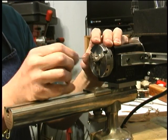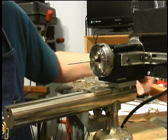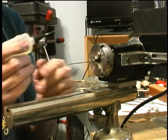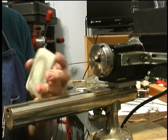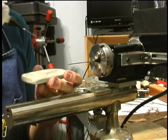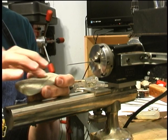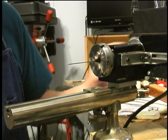We're going to put the rod that we're using on the key instead of the wiggle rod in the chuck, and we're going to lap it in a little bit. Lapping is using an abrasive compound. I've got a bar of lava soap that has pumice stone in it. I'm going to put a little oil on it, rub my finger around in that and make a little paste out of the pumice stone. Put that on the rod, and we're going to lap the key to that.